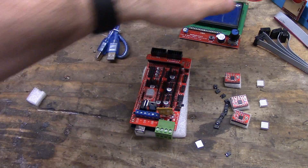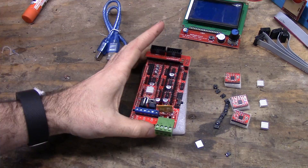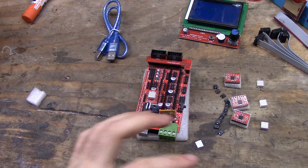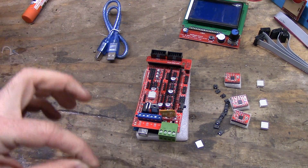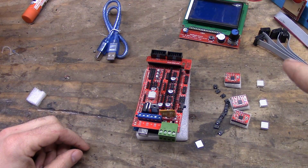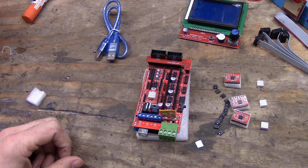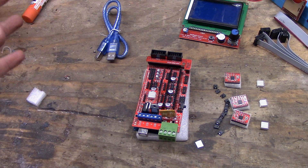The end stop pin order is X min, X max, Y min, Y max, Z min, Z max — look this up, I can never remember and they're not labeled. These three-pin connectors support powered stop sensors, but if you're using the 101 Hero you do not need the center row — it's voltage positive. You just need signal and ground, the outer two. The sensor cables don't really fit on there directly; I make short adapter cables with pins that go into just the outer two slots.